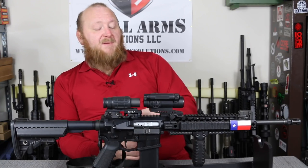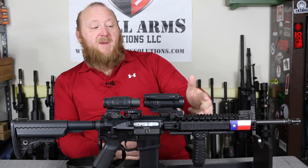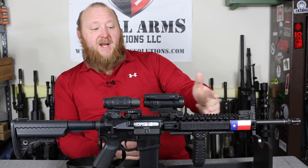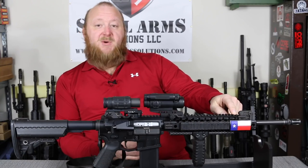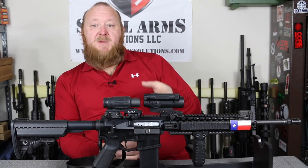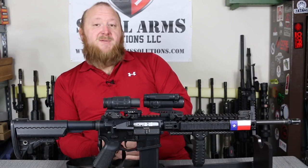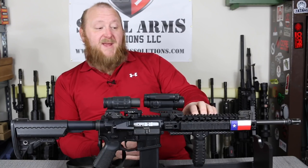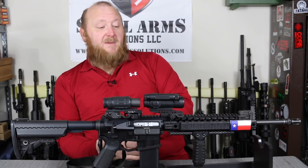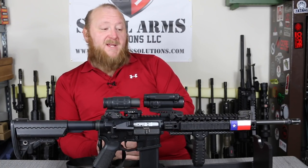By having a mid-length system, it puts you on a nice sweet spot in between that of a carbine and a rifle. So it's basically like a 9-inch versus a 7-inch gas system. The most important thing that does is it increases your dwell time, which is the amount of time that the bolt is closed, which allows the pressures to drop. So when the bolt does start to unlock, you have less residual pressure, so it makes for easier extraction. So that is the reason why I am very fond of the mid-length gas system that was developed by Mark Westrom out at Armalite. This was his baby. So any rifle that I build will have that mid-length gas system on it.